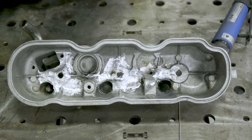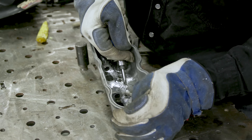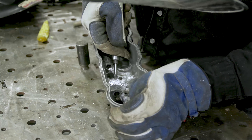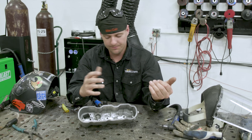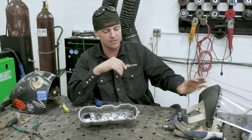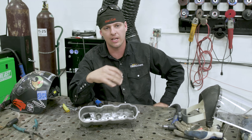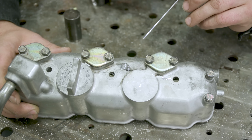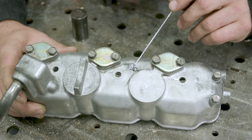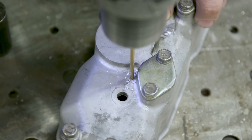All right, we got all the inside welded up. We're doing a little smoothing, grinding out the crowns and uneven points, and then we're basically done with the inside. We got this all blended — always wear your safety gear; I always have my shield and earplugs on. It's almost looking like original. Now here's the top side of the valve cover — you can see the cracks. That's some pretty good penetration there. We're going to drill stop holes on the cracks up here and then load it up.